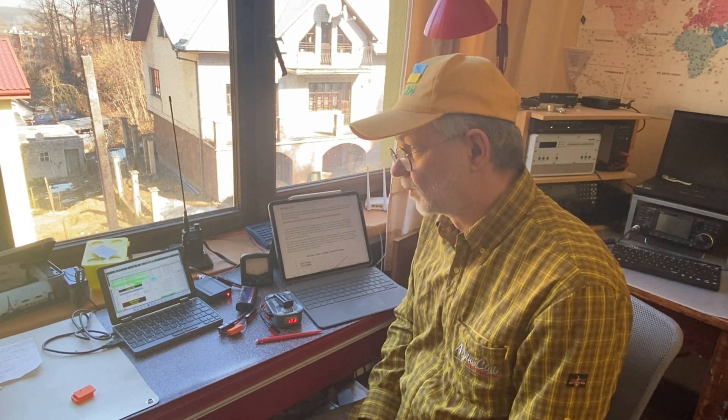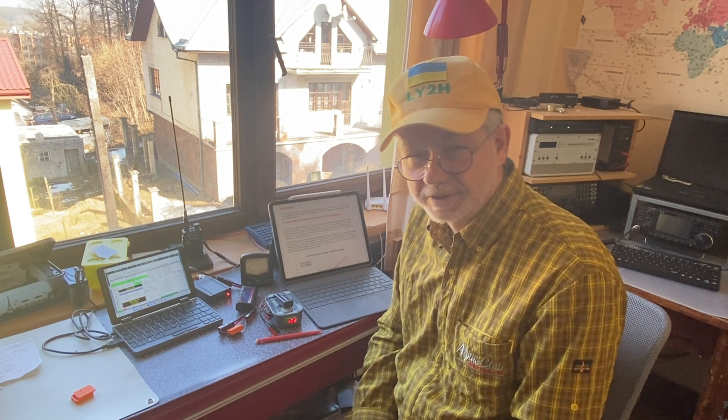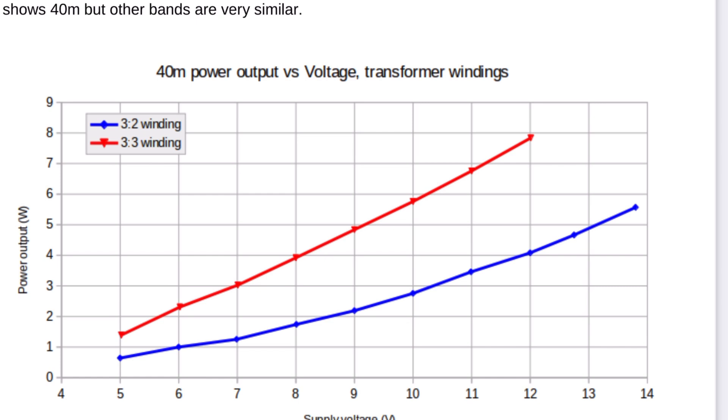What's the difference — 9 or 12 volts? Many people choose the 12-volt option because they have 13.8-volt fixed power supplies in their shacks, and it's convenient because all equipment is fed from the same supply. But if you are like me and going portable with the QDX to operate in digital modes in the field, then I've decided to go for the 9-volt power supply.